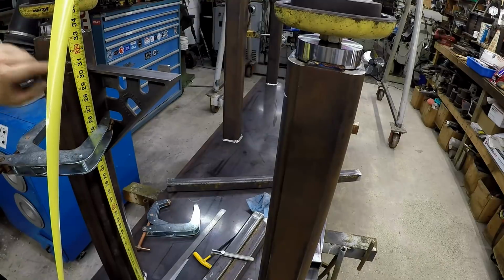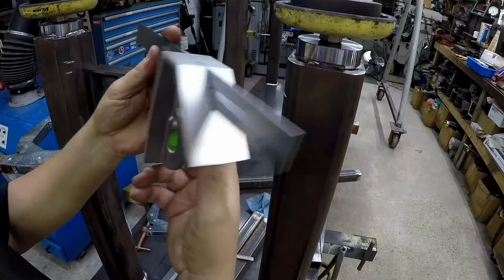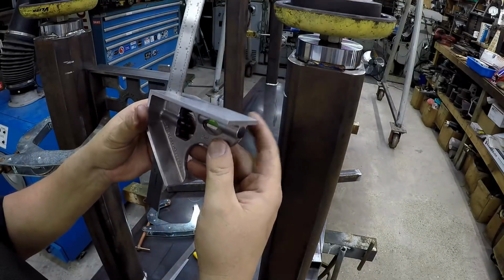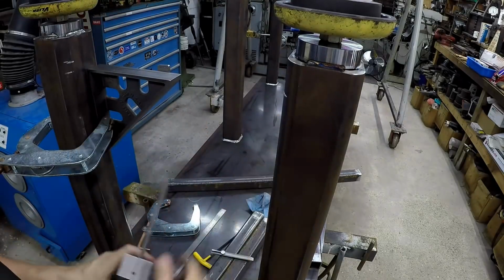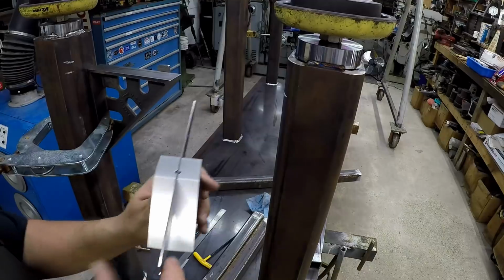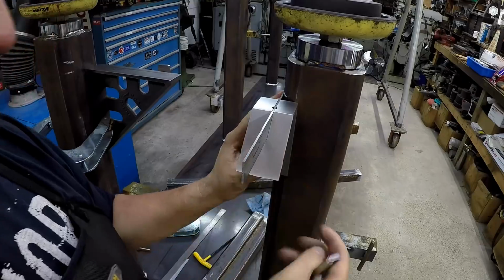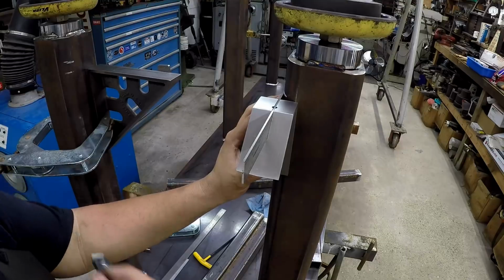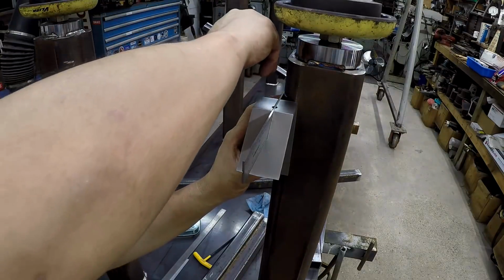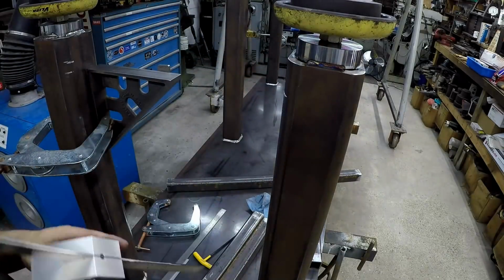So we're going to make a mark at 31 inches along the tubes, and this is where this guy right here comes in, that new LA square that I picked up from Epstein Hardware. See how wide it is? So this will allow you to get in there on these tubes like this with these large radiuses. I've got a mark there, and I can still get in here and completely square it up on this flat, and then my rule is on that side, and be able to make my line right there. That's cool.